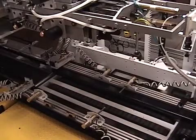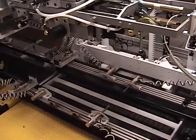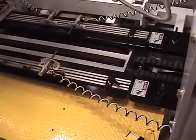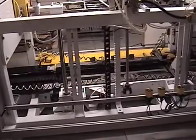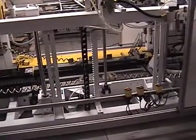The SML elevator is 4 feet long with a backplate constructed with 1 inch thick by 6 inches wide steel and 5/8 thick side bars. A 1/4 inch thick deck plate for the operator to stand on for job changing is available. The elevator case feed includes swivel-mounted quick disconnect photo eyes and reflectors mounted on adjustable 80/20 extruded aluminum bars.